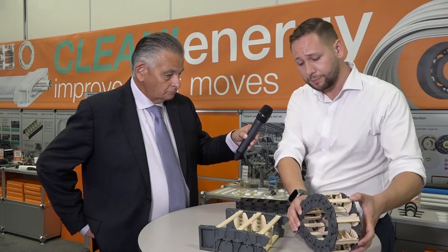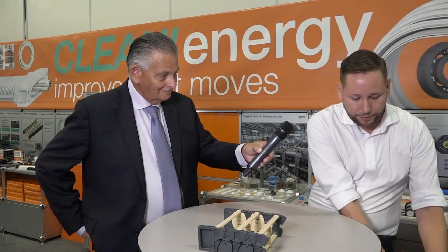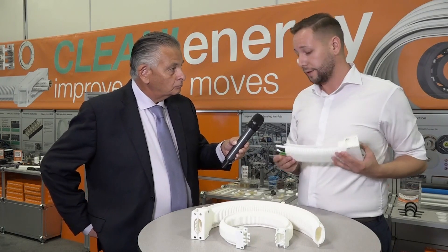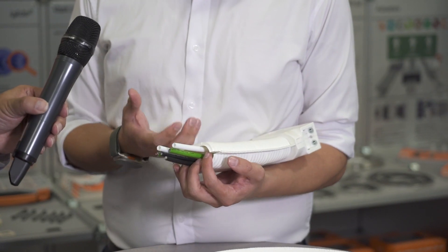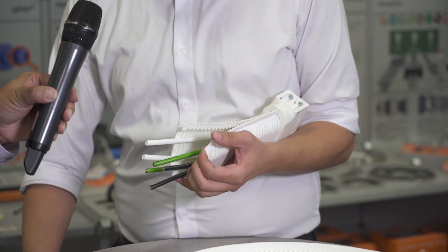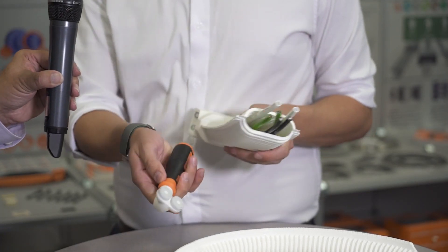So this was our C6 for SMT applications, for example. What I want to show you now — a very cool solution for ISO Class 1 — is our fully enclosed system. Because some customers don't want to even see the cables inside of a cable management system. The benefit here is that it's very easy to open. It's so-called E-Skin. It's a skin around the cables. It's fully openable — you can easily install the cables. You have an interior separation system inside, and with just one tool you can easily close the system.